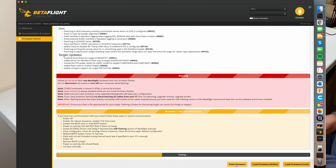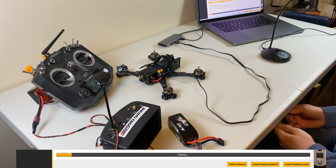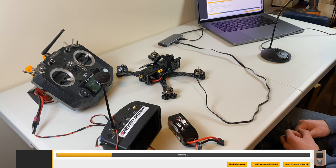It'll take a couple seconds and it'll put my board in DFU automatically. If you're having trouble putting your board in DFU mode, there's actually a little button you can click on your board, and if you hold that in when you're plugging in your board, it will turn it to DFU mode automatically. All my content just got erased and the drone is being flashed with the newest firmware right now. This will take about 20 to 30 seconds, and then we'll be ready to set up programming.